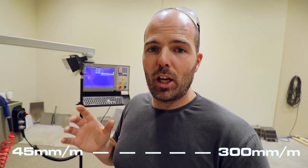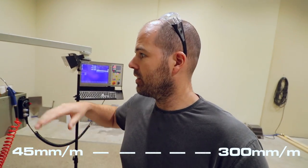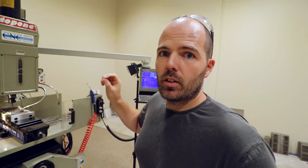I was initially doing 45 millimeters per minute. So when you see it going along, it's spinning around and it's going along, and that movement was 45 millimeters a minute is what I started with, and I increased it again and again, and I'm now up to something like 300 millimeters a minute. And you know, it's sounding okay. There's no squeaking, especially when it gets into the corners.